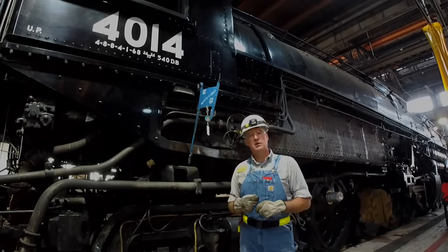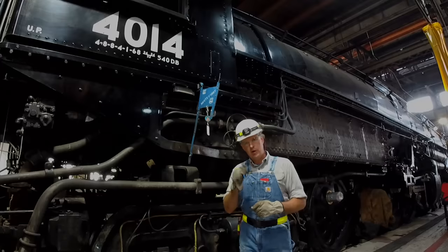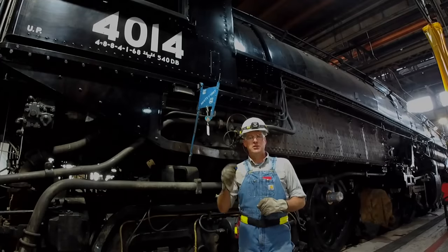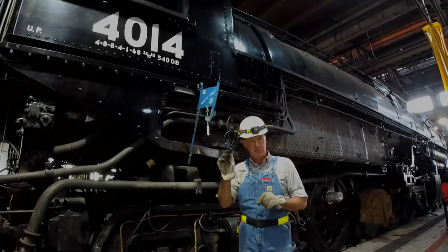The fireman is controlling that oil burner, controlling the amount of oil flowing by gravity, and it's atomized with steam pressure and burned. One of the key parts on an oil-burning locomotive is the type and quality of combustion, and that's 100% manually controlled by the crew — namely the fireman.